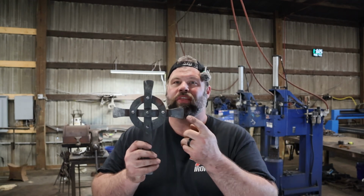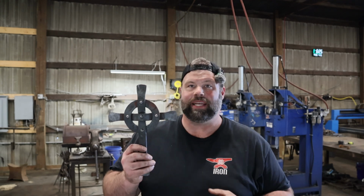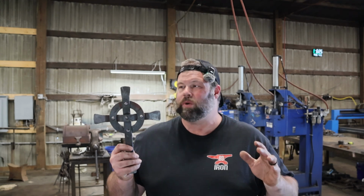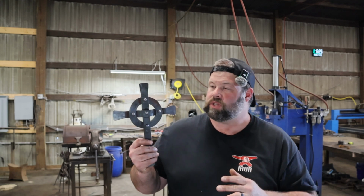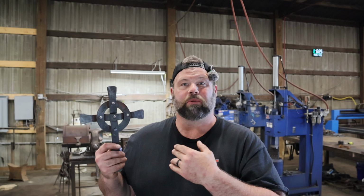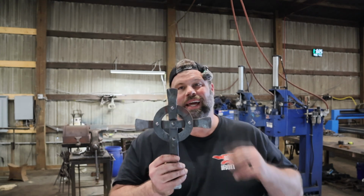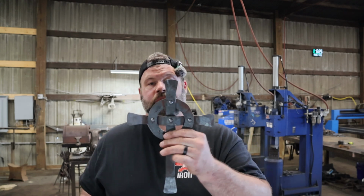But another thing to remember as you're forging these, try not to go too deep with your cross peen hits, and that way you can smooth and planish them out. Something I've always struggled with, because I'm just trying to move the metal really quick, is I'm just wailing away. What I really focused on in that bit was taking my time and trying to make sure I was distributing my hammer blows evenly to the left and the right to spread that finial. I kind of struggled on the first one, but on the last three, I felt like they went pretty smooth.